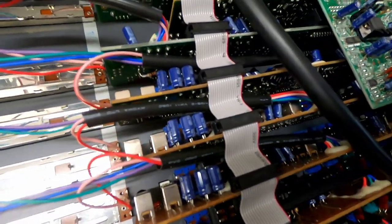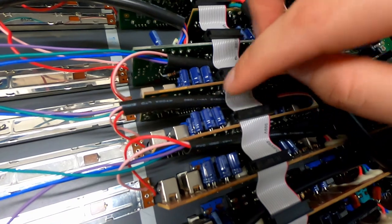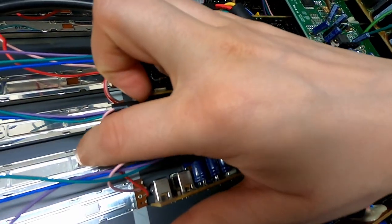And that's it. I'm going to put this back into place, flip it over, turn the pan knob, and then I'll show you how to clean the faders. For the faders, I'm going to squirt it in from the other side where the actual fader knob is.